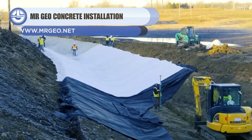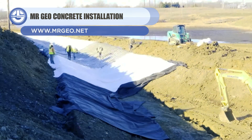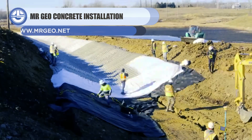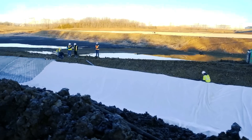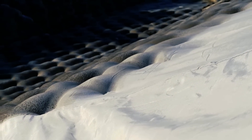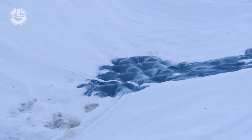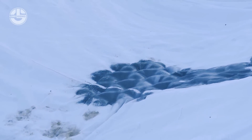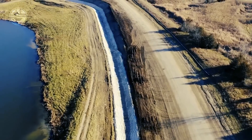Up next, we have the Fabreform. It is a special kind of concrete that can be formed into customized panel sections and patterns. The unique mattresses are then filled with high-strength flowable concrete grout, which hardens into an evenly-patterned concrete lining system. The positioning of forms and the pouring of concrete do not need any additional equipment. It is resistant to most chemicals as well as industrial leachates.